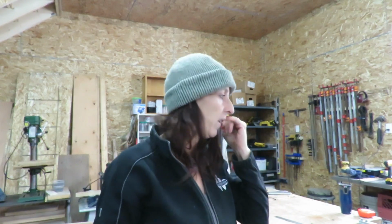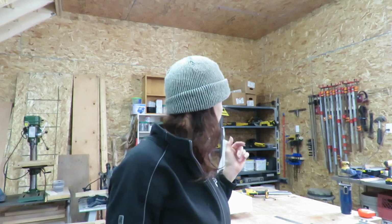on the front side of the island. On one side, the drawer could fit all the way back, but on the other side, the outlet was like a half an inch too far forward for the drawers to fit. I bought some 19 inch glides, so I made the drawers 20 inches because that's what fit on the one side. So I go and I try to fit them in, and it doesn't go all the way in on the other side because the outlet's too far ahead.